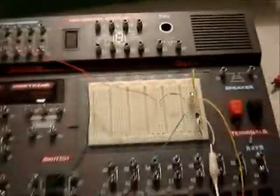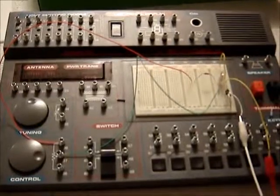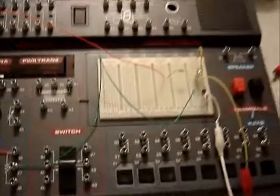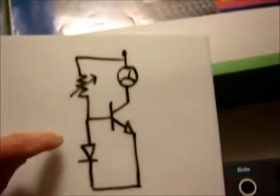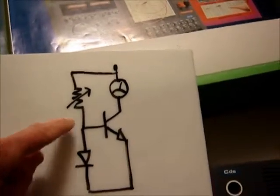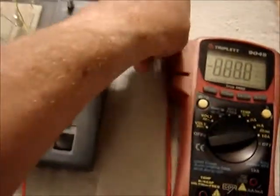It's time for a demonstration. I have this RadioShack 301 lab experimenter kit — brand new, never been used before, never opened the components. I don't know when they stopped making these things, but it's probably been 10 years or so. I have set up a circuit on it, and I'll just use a small transistor. I'm kind of mimicking a fixed voltage bias circuit here, with the meter and the NPN transistor. I'll turn on the meter to current and hook it up.